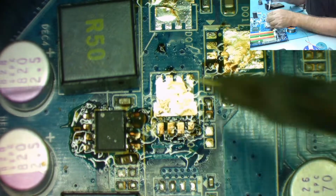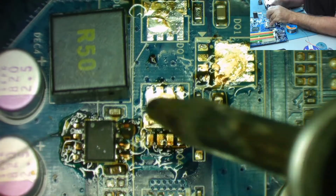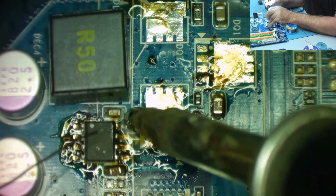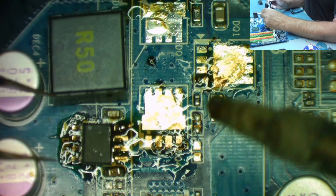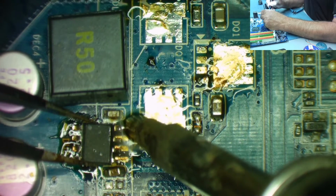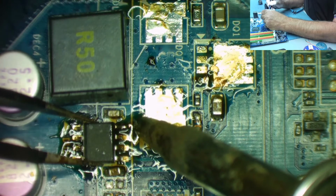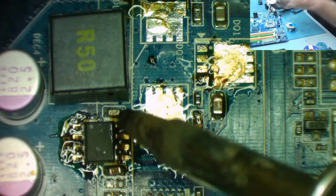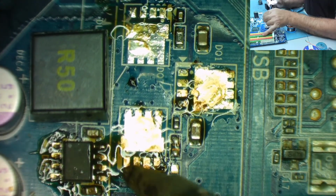So I'm bringing the soldering iron in the other way. Yes, I've actually got the flat side of it against the board. Get a bit more heat in. Oops, now I've moved it. Okay, but we've got a bit of solder on the tweezers. And I've straightened it up. So that's nicely gripped by one leg, it's going nowhere now, yeah? So we can get a little bit more solder.